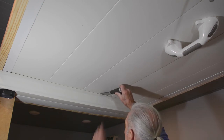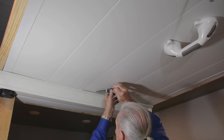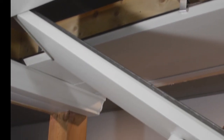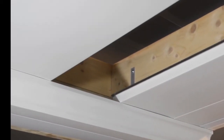After the panel latch is disengaged, slip a stiff blade between the panel and the gutter and pull down to relax the grip of the panel on the gutter. With the suction cup attached, pull the panel toward the gutter and slide it free of the back wall channel. Twist the panel toward the flat side. When the overlapping side of the panel is clear, remove the panel.